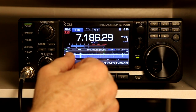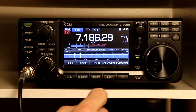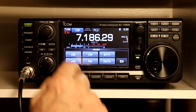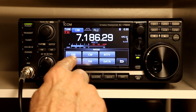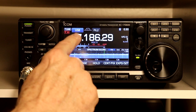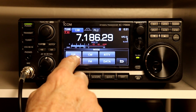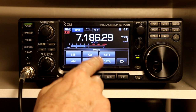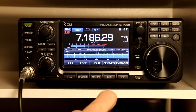The next part on 3.3 is selecting the operating mode. If I want to change modes — we're in lower sideband — if you just touch the mode on the screen, it brings up the mode selection. You'll notice there is no LSB or USB here, it's just SSB. So if I touch it again, it'll toggle. Each time you hit SSB it toggles between the two sidebands. And then there's the dash-D — if I hit data, it puts it into data mode.